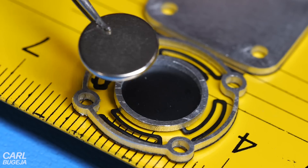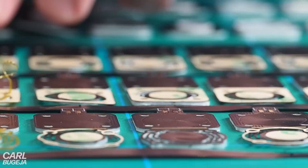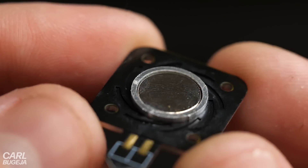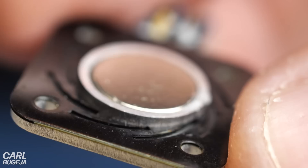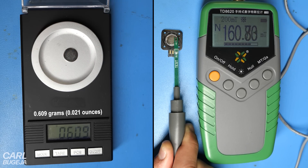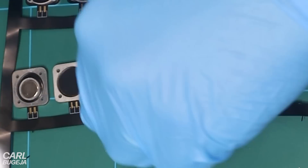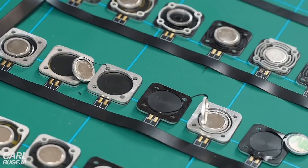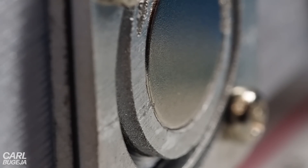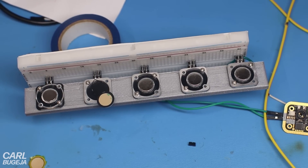Some samples were just too fragile to even assemble, and others were definitely too stiff for the coil to push, so I eliminated those to test the rest. The magnet was meant to be mounted inside the ring, so the adhesive was placed on the wrong side. Instead, I left the adhesive unpeeled and glued the magnet. This magnet is a little big for the flexure but has the same thickness as the aluminium ring and a very impressive strength-to-weight ratio. As soon as I glued the magnet, some spring designs immediately broke as they started getting attracted to neighboring magnets. The aluminium sample didn't break, but it was too thick for the coil to actuate.